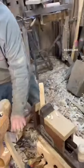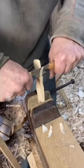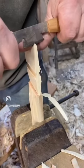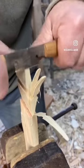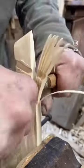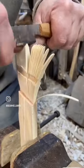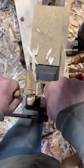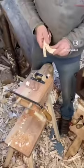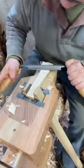Using the draw knife I'm finalising the shape of the wings. My next step in making fan birds is to split the feathers out — I'm not cutting, I am splitting the wood like you split firewood. I make and sell these little knives. And now just to thin down the hinge with the draw knife. I do love the natural sounds of wood being worked.